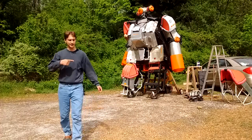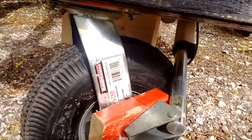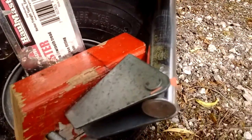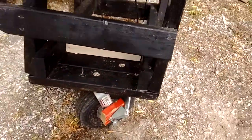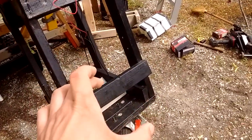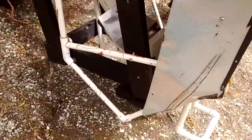Let's take a look at the innards. So, the stud as a stopper looks like it worked as planned. You can see that when it's turned to the right, the linear actuator actually wanders away from the stud. So that's interesting. It goes on these hinges and stuff and flexes around. That's something a lot of people don't realize about linear actuators and hydraulics and stuff. You gotta make sure they pivot at both endpoints, otherwise the magic won't work.